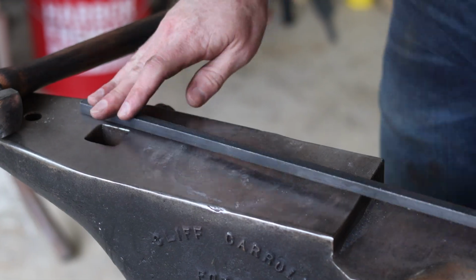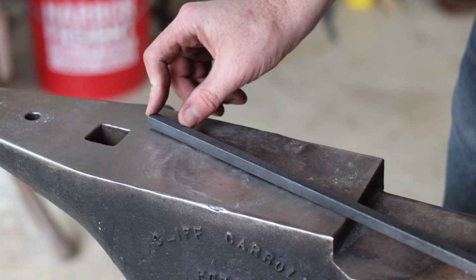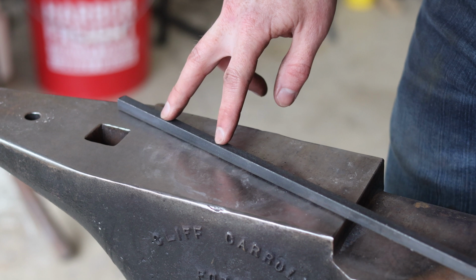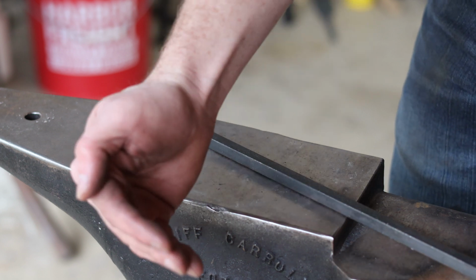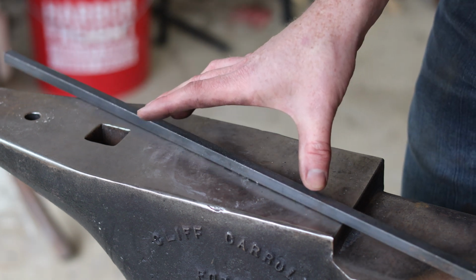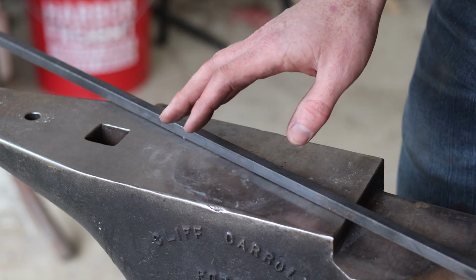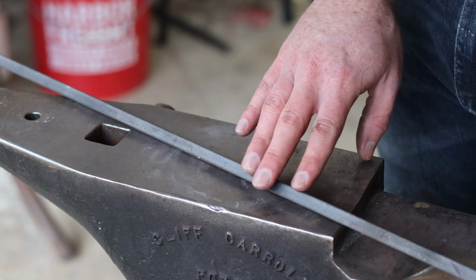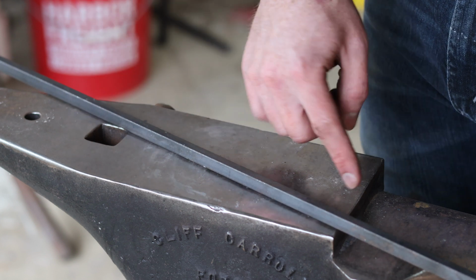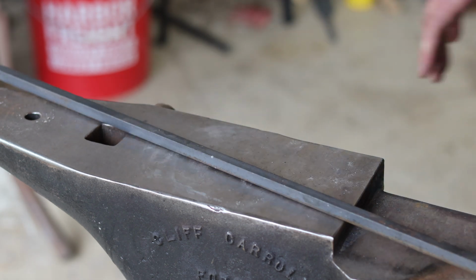All right, so I've got this piece of 3/8 inch square stock that I'm going to be using to make this towel bar. And the plan here is to flatten about 1.5 inches of steel at one end of this bar, measure out about 4 inches for the standoff distance from the actual shelf itself so that the bar kind of sticks out from the back of the shelf. And then I need at least 8 inches in width to hang a folded in half hand towel on, another 4 inches, and then another 1.5 inches, and I think that should get me an okay looking little towel bar to screw into the bottom portion of the shelf. And then I'm going to put just a nice decorative simple twist in this, one direction on one side of the center and the opposite direction on the other side, so that it kind of twists down in both directions to the center of the bar. So let's get this to the fire and let's keep on rocking.